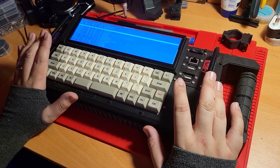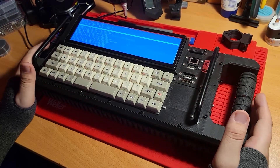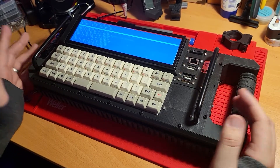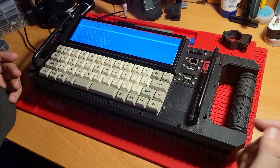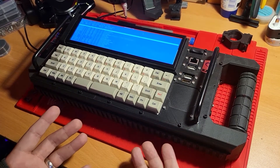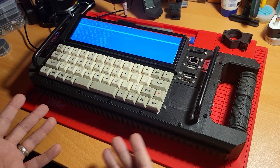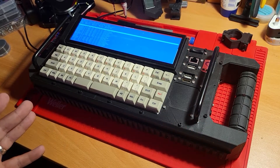Inside here we are running a Raspberry Pi 4 using the PiJuice hat connected to a lithium-ion battery to supply power. Because it's running a standard Raspberry Pi, we can just load up any version of Linux that can run on ARM straight into here, including the cybersecurity-focused Kali Linux if you wanted to have a full set of cybersecurity tools straight out of the box.